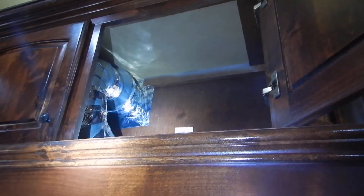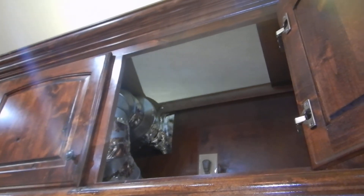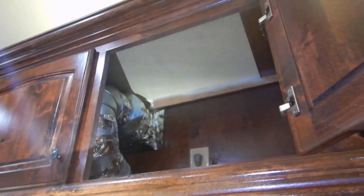The vent fan works, the vent fan light works. Now, see the black tape on the wall back there — it's like in a square. That looks like a fire blocking plate, but that's not a fire blocking plate. That's a faux plate. You're supposed to have a real fire blocking plate. And on the kitchen sink...